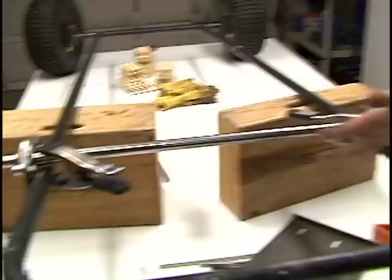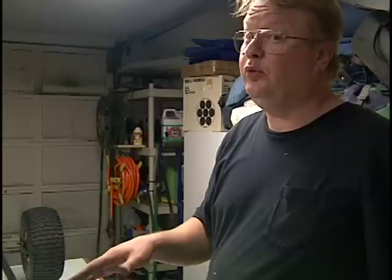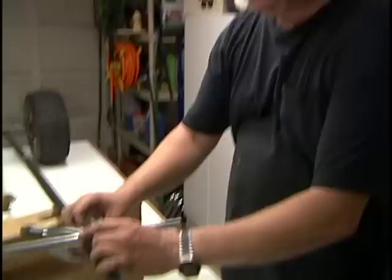We're going to run the axle on top of the frame, because if we put the frame on top of the axle, I think the go-kart might have a really cool sort of West Coast back end, up being way up in the air. But with this setup, it'll still be up in the air. It won't be crazy. Now I'm going to tack weld these tabs right here to the frame, and these tabs hold the bearings.